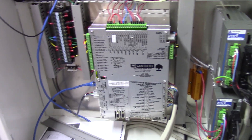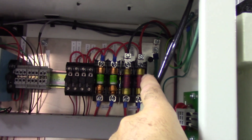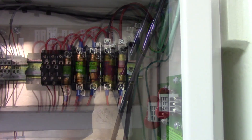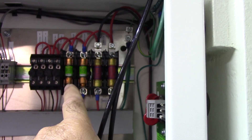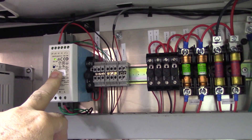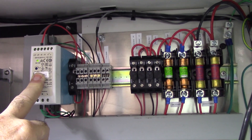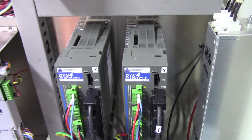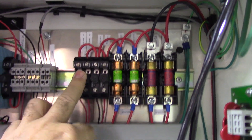There's the Centroid Oak — this is a true closed-loop motion controller. At the top I use fuses rather than breakers because fuses tend to trip faster. Fuses on the right are for the servo drives; fuses on the left are for the VFD and spindle motor. The second set of fuses is control power for the Oak and the auxiliary 24-volt power supply, which powers the solenoids for the power draw bar and air curtain. A third set of fuses covers the logic power for the DMM Dyn4 servo drives — that logic power drops through an EMI filter which feeds the drives directly, so when the control powers up, the logic power to the drives powers up as well.